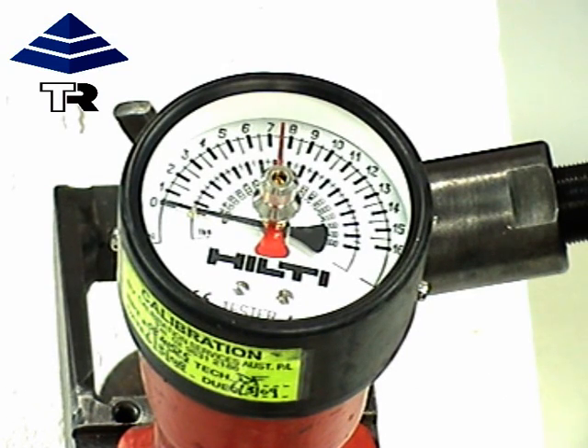The load on the safe ring has now been sustained for two minutes at 7.5 kN, which means the safe ring is in full compliance with Australian standard 1891.4-2000 industrial fall arrest systems and devices.